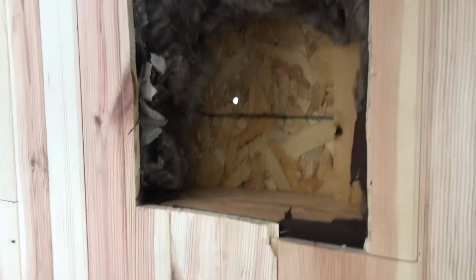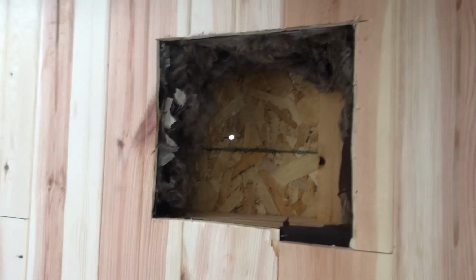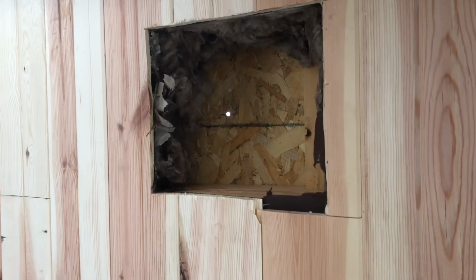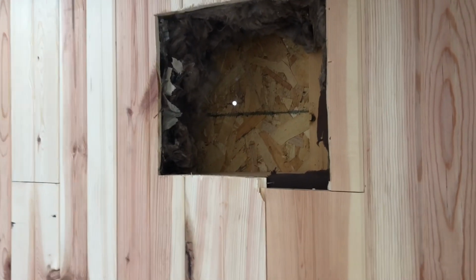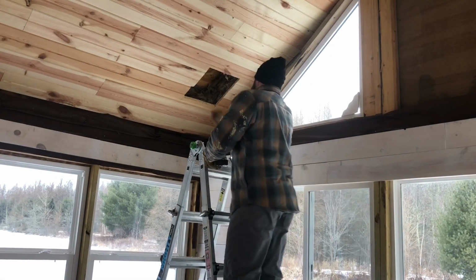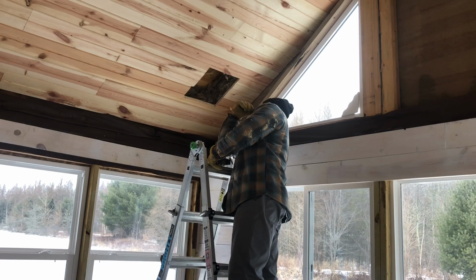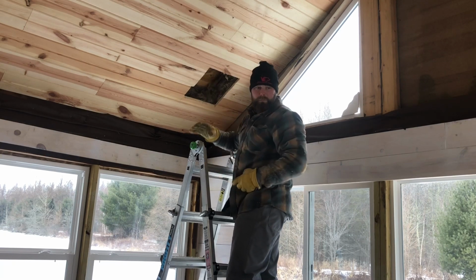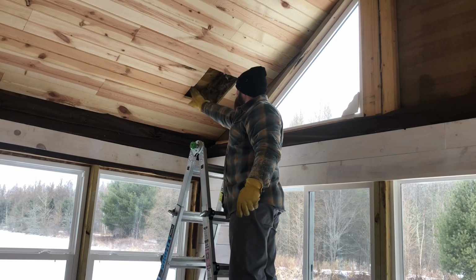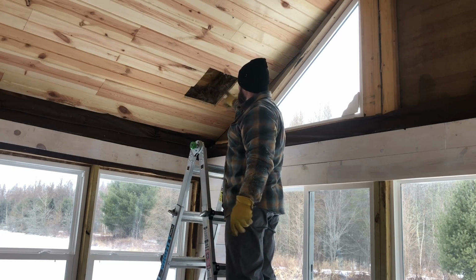And I got down, laid on the ground, put the cathedral ceiling box in, and you could tell that it's in the middle of where everything's gonna ride. Now I have to take boards, which would be 2x6s or 2x8s. I gotta find some 2x8s, and then box the inside of this all in. So I have framing on all sides.